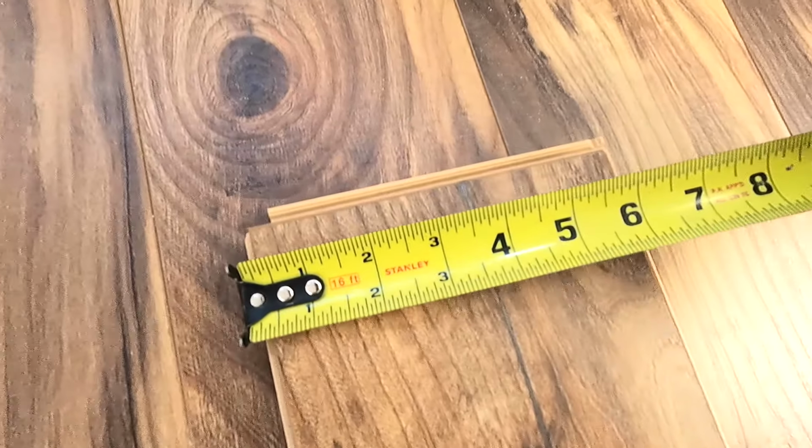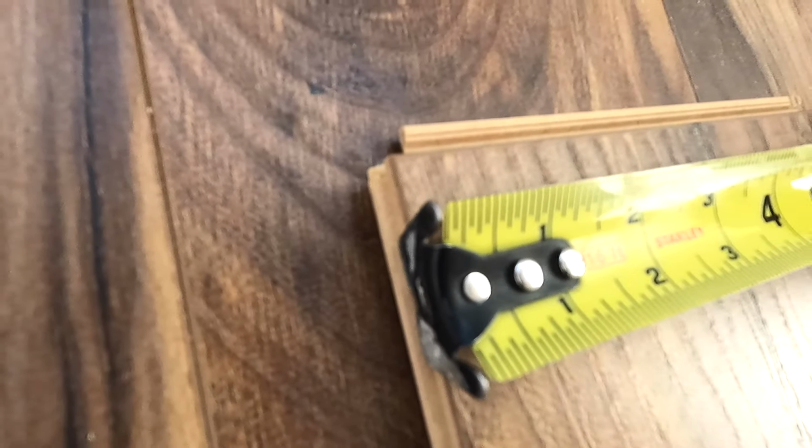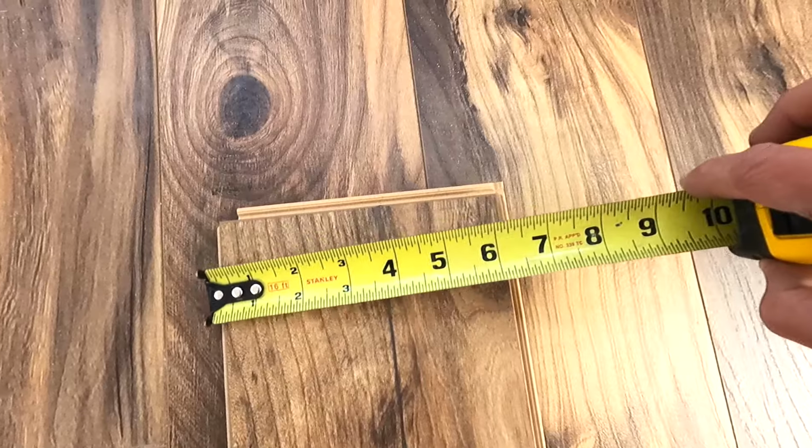Now, in terms of cutting this piece, I'm actually gonna use a table saw. You can use a circular saw, jigsaw, anything you want. So, table saw is the fastest, but you know, use whatever you have. All right, so when you go mark this piece to cut it, what I wanna remind you is, I don't want you to hook the tongue right here. I want you to hook the finished edge here, and that's where our 3/8 comes into play. So yeah, make sure that's really important.